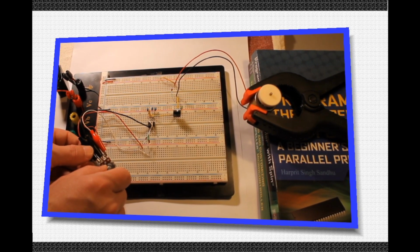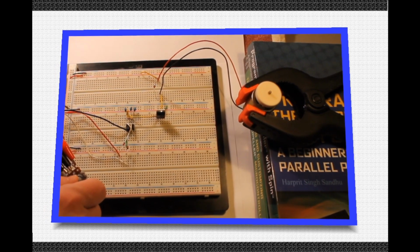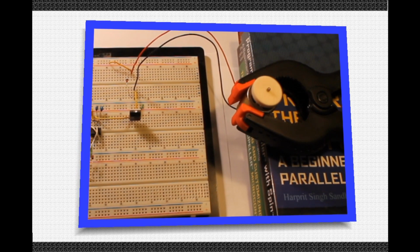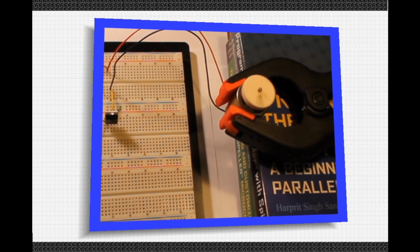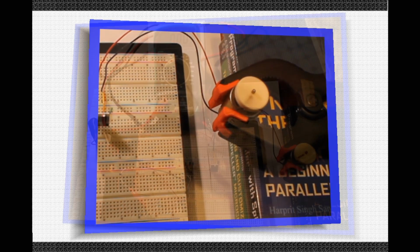Notice that I'm able to slow the motor down even to the point where you can actually see the mark I've made on the Dremel buffer I've attached to it. The motor is running at full power, even at this slow speed. That's pulse width modulation. Let's take a look at the current the motor pulls while this circuit is running.